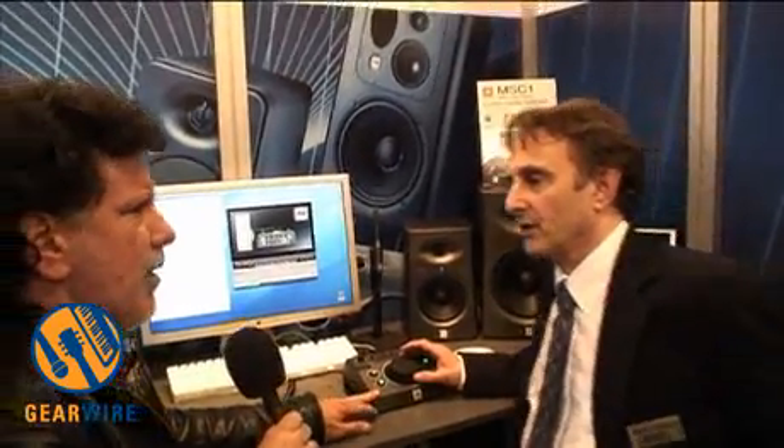You can use this with any of the low-end speakers. This will work with anybody's speakers — passive or active. Basically, you feed your stereo mix to the unit and fan it out to multiple sets of speakers. You can also plug multiple input sources into it, so it doesn't matter what speakers you're using. In the case of passive speakers, you take the feed to the power amp into the box and out of this into the power amps.